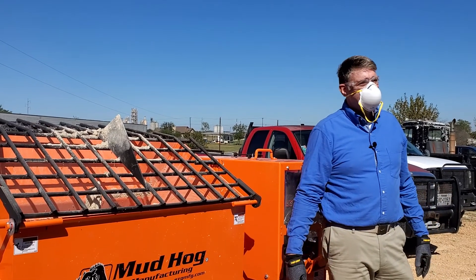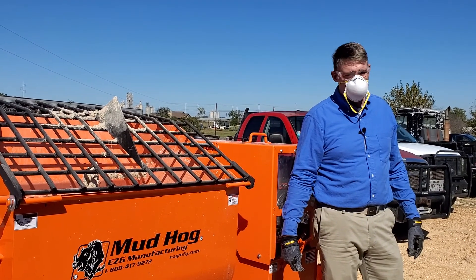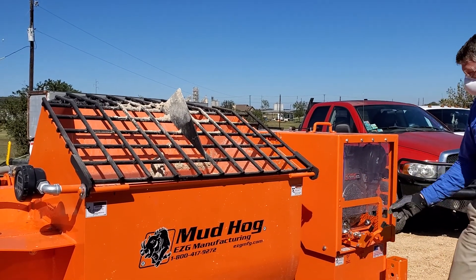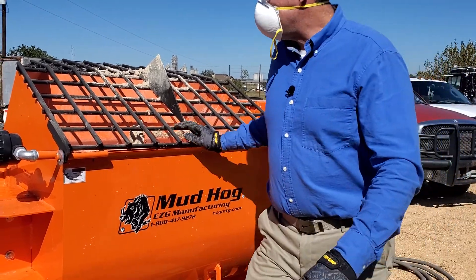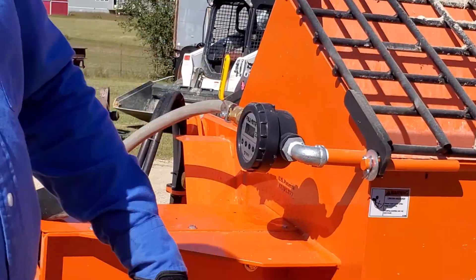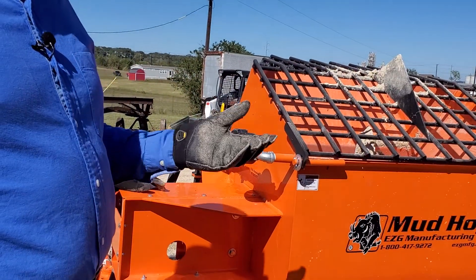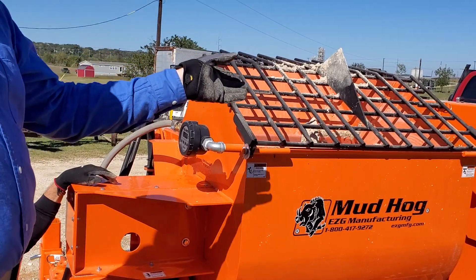I see room for error. I see room for high levels of function and productivity, but it also could malfunction. If this malfunctions, you can kind of know what's going on. So we'll start her up and mix our batch, and then it'll dump out the end. The water gets metered through here, and this little meter — as you're mixing batch after batch after batch — a production workday is about 50 to 60 batches. Each batch is about six cubic feet.